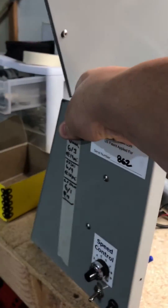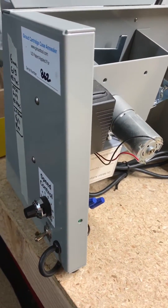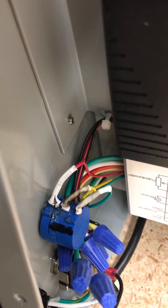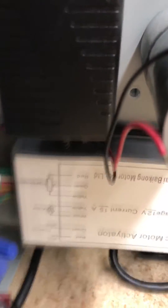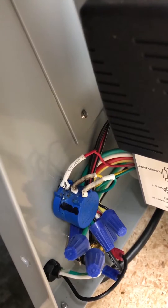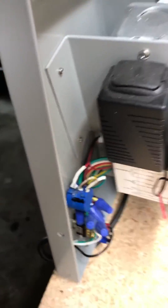Installing the potentiometer is where it got a little bit tricky. The hole in the side of the unit has to be opened up a little bit — it requires a bigger drill bit, not a huge deal. On the inside — excuse the soldering here — the wires are short and it is fairly hard to solder, not impossible but a little difficult. More importantly, pay attention to the order of the wires: you've got red, yellow, green going from left to right. In the original wiring diagram it goes yellow, green, red, so just be aware of that when you solder it in. If you've got decent soldering skills this is not that hard to do. I've got the case cover off so you guys can see this — it is a little tight working in there but not impossible.